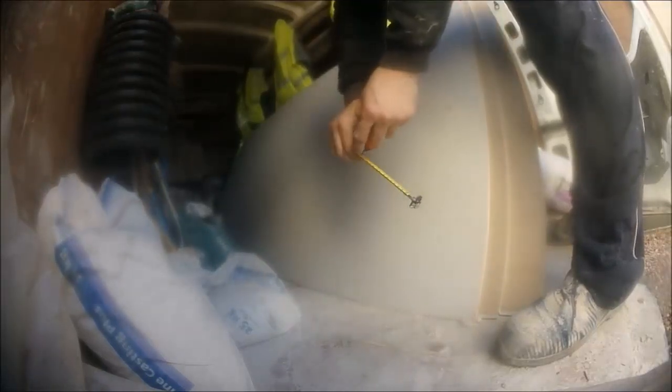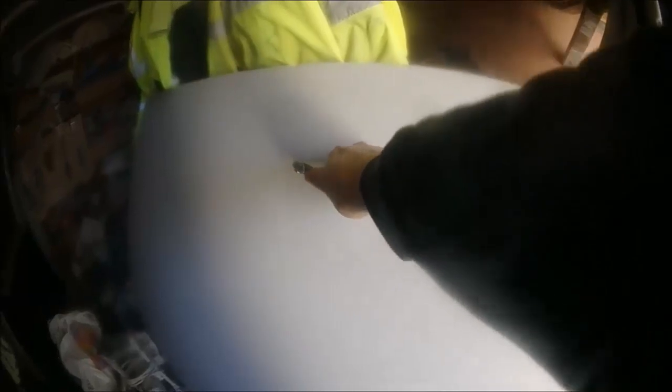You can just clamp your finger on whatever measurement needs to come off and simply mark the plasterboard with the end of the tape, pulling it along to keep a nice consistent margin. Then you have a perfect line to slice along. Once you've cut one side of the paper it's just a matter of snapping and folding the plasterboard over. I'm doing this in the back of the van — it keeps the driveway cleaner, and if it rains the plasterboard stays inside. You do not want your plasterboard getting damp.